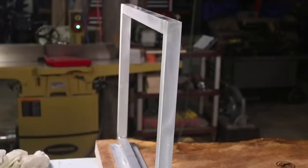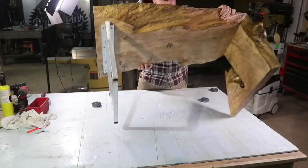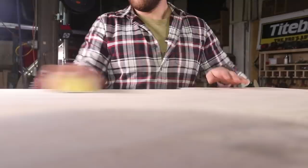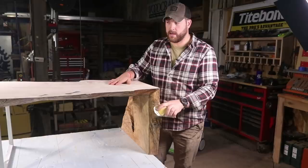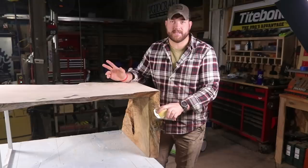We finished the bottom and mounted the leg just so I could work on it a little bit easier. Now I water popped the top — I'm gonna hit it with 400 grit to knock down all of that soft grain and get some finish on this thing. I'm softening up all the edges with the same 400 grit. For all the haters out there who are gonna say this table isn't child friendly — of course it's not child friendly, it has a massive point sticking out the side.